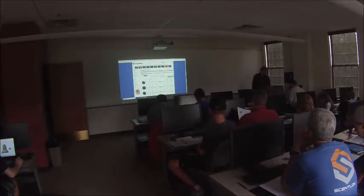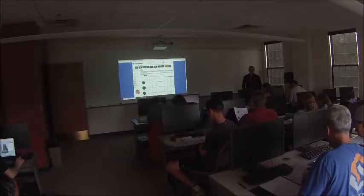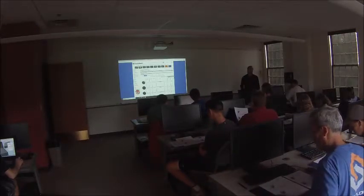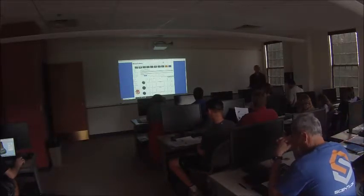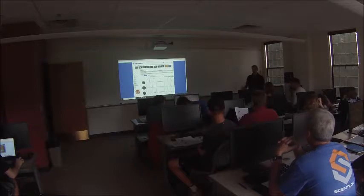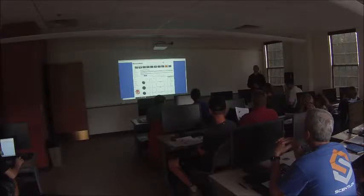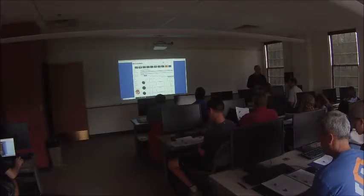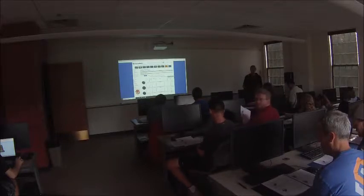Okay, so the next type in your handout is called a Coulson wheel. Coulson wheel is made by the Coulson Caster Company. Originally, they were meant to be an industrial caster. And a caster is basically just a free rolling wheel, like your desk chairs, right, those little swiveling wheels at the bottom, those are casters, okay? So the Coulson Caster Company makes casters for industrial applications, like material transfer carts, paint racks, just heavy duty stuff for use in factories and things.